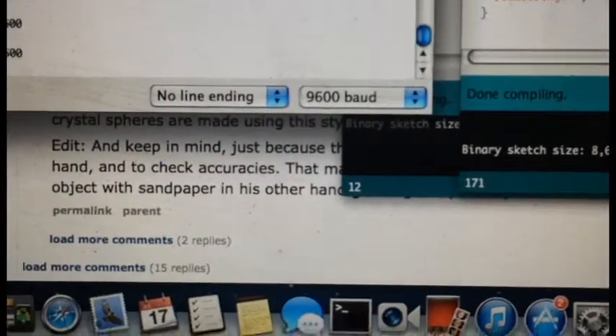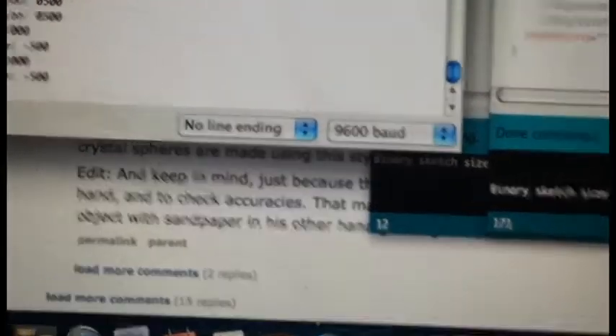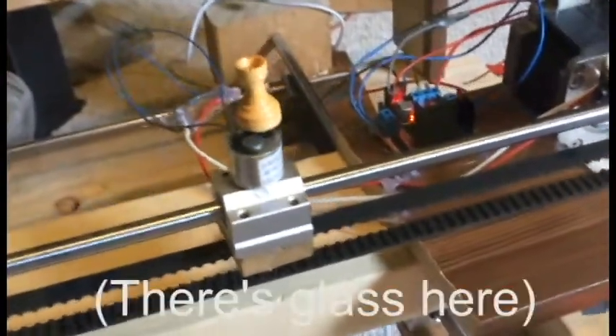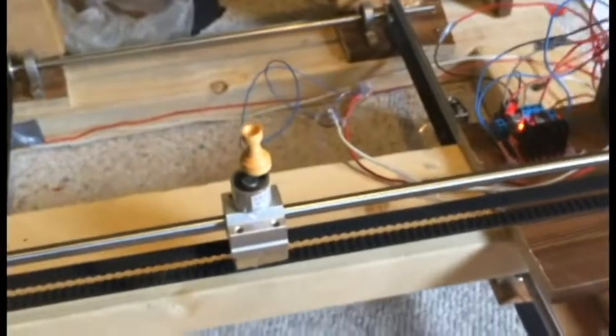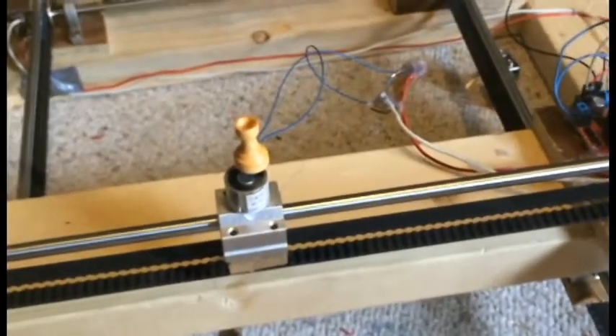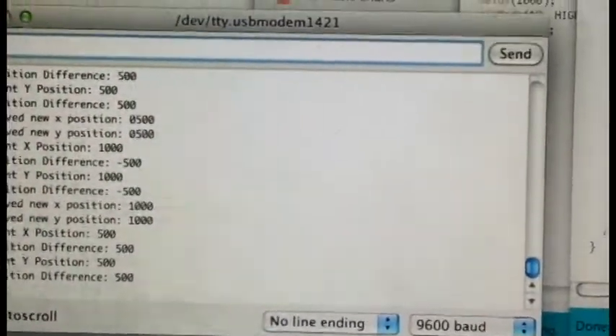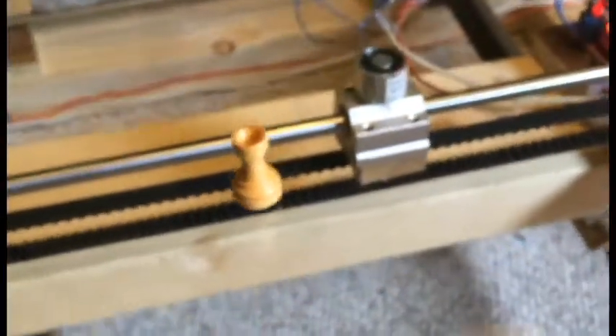In addition to just the fast move without an electromagnet, if you enter positional data — let's send it to 1000, 1000, on — that string turns on the electromagnet, so when you move, it'll move the piece. We can move the arm again. Let's move it all the way back to 0,0. The electromagnet isn't engaged anymore and it leaves the piece right there.